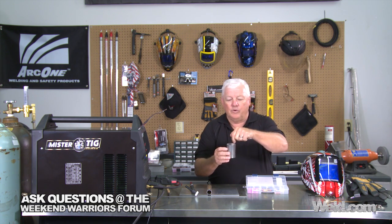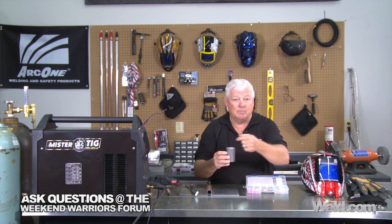The 040 will only handle up to about 70 amps and it's designed for very, very fine welding — jewelry-type welding, gun repair, very fine edges. If you take a tube like this, about 22-gauge material, and you want to weld on the edge and restore something, your machine has to be able to go down to low amps. This machine goes down to 5 amps, so I need to put a tungsten that will allow it to light off at 5 amps — the 040 tungsten.